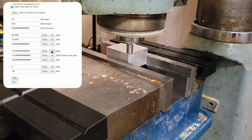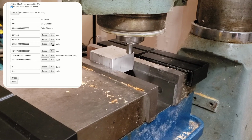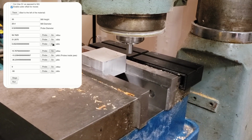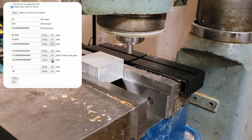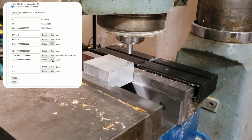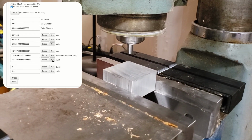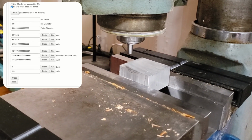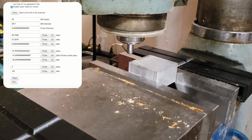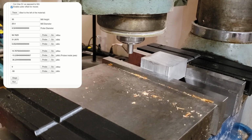So here it'll just walk around, and if we had a 1-inch cutter on here, it would basically be just grazing the stock all the way around. And this enables us to say, okay, here's my cutter size, go to the edge, and then come in some amount from the edge, and we don't have to worry about doing all of the manual calculations around the size of the cutter. And that'll make it a lot easier to cut out the T-block that we've been poking at